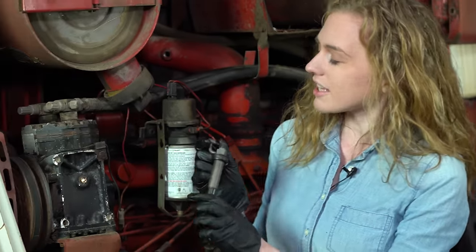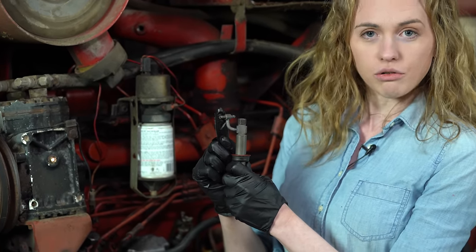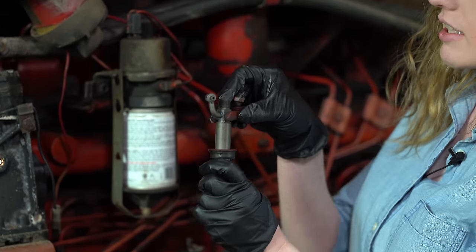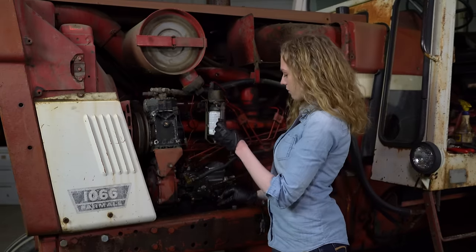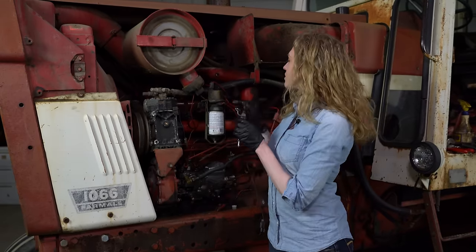So when I put this into the tractor, I always want my lines here to go towards the back. And also, I'm looking, this clamp is gonna go on the side like this. So it's gonna insert, drop in there like so. Notice that I do have my existing rubber in here. And then also the brass sleeve stayed in my block. That's good.